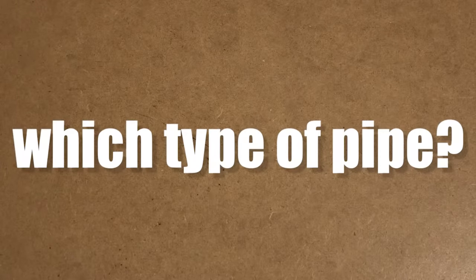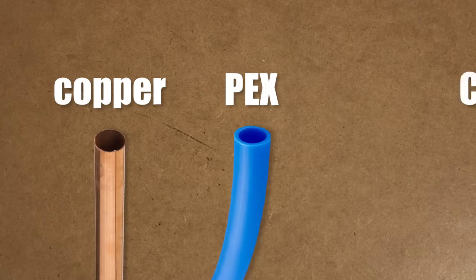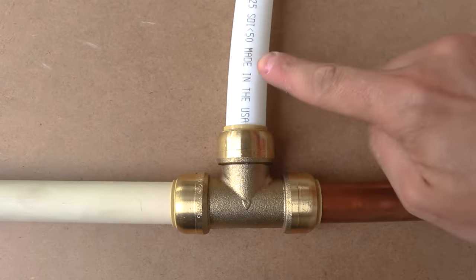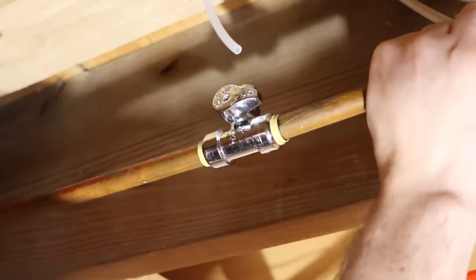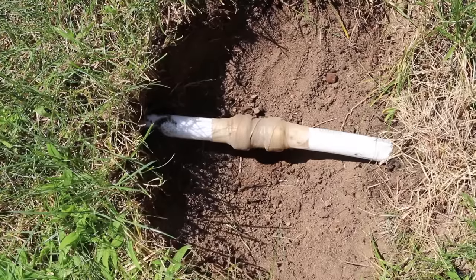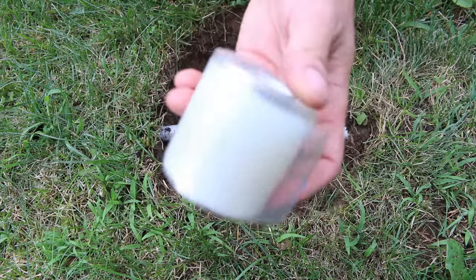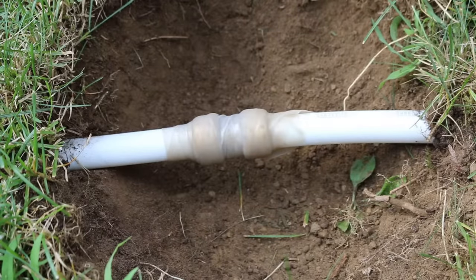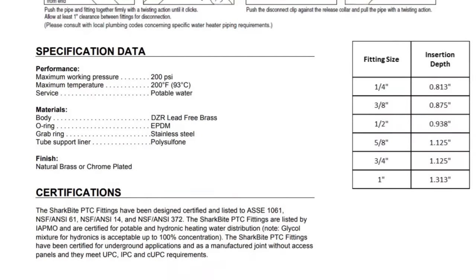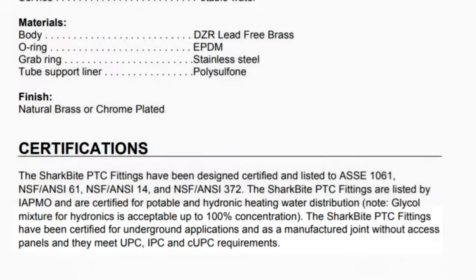On which types of pipes can you install these, and where are they meant to be used? They can be used with copper, PEX, and CPVC. You can also transition between any of these three using the same exact fitting, which is pretty neat. SharkBites can be used exposed or unexposed in walls and in the ground, whether for potable water distribution or heating applications. If installing a fitting underground, it must be wrapped with SharkBite's self-adhesive tape to be code-compliant and to prevent contaminants from getting inside the fitting. Many people, including myself, don't feel safe installing these where they aren't accessible — but if everything is done properly, there's no reason to doubt them as they're approved for these situations.